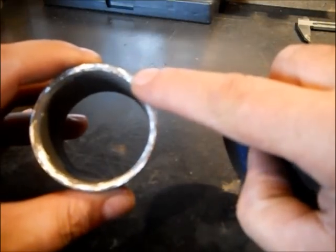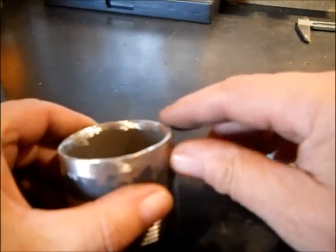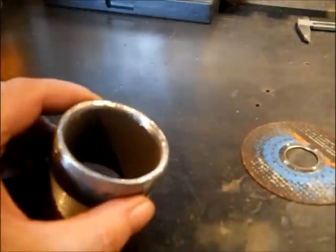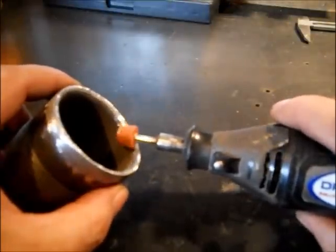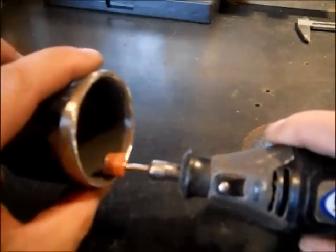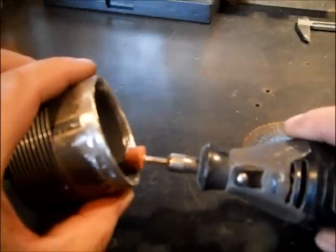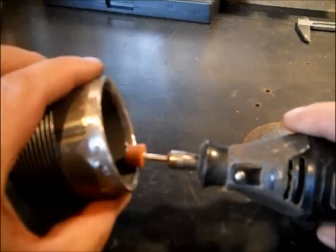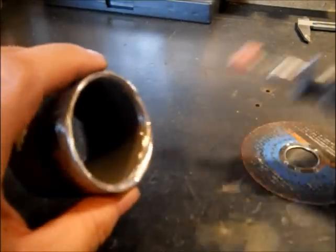Get this thinner out here. Then I used this, which was tapered from another project, and I did go this way a lot, but making sure I keep the angle on my stone. I'll change it once in a while — I'm always wearing the tip more than the back for tapered work.